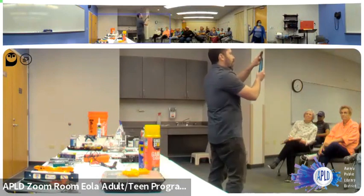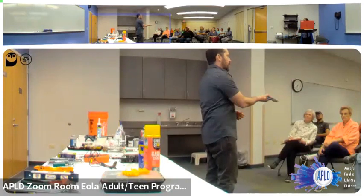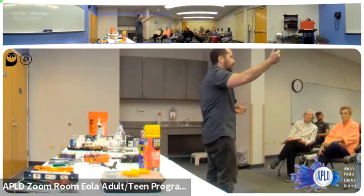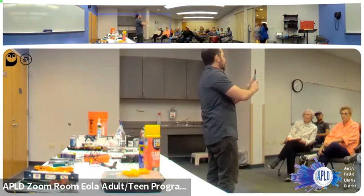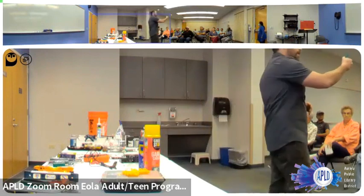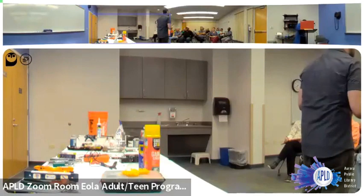First of all, that head being offset just makes it way easier. Usually we're gonna turn things with these, okay? So not being straight on gives me a lot more ability to do that successfully. Two, the longer handle. They're gonna give you more torque in actually squeezing something so that you don't damage it. Additionally, because I have all these grooves to choose from, I can keep these feet fairly parallel across a really wide range. So I can grab things from sheet metal to, like, with this sort of medium-sized pair, I don't know, 2 1/4 inches, and not mess them up, okay?